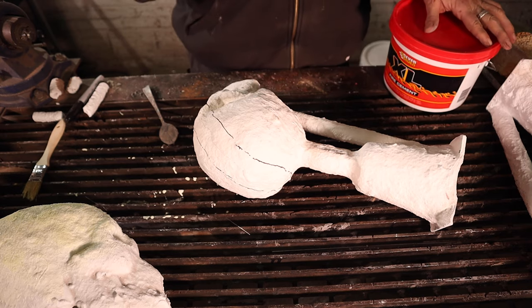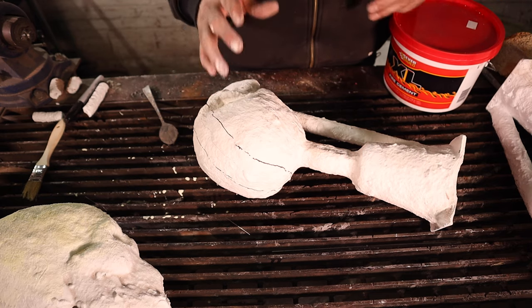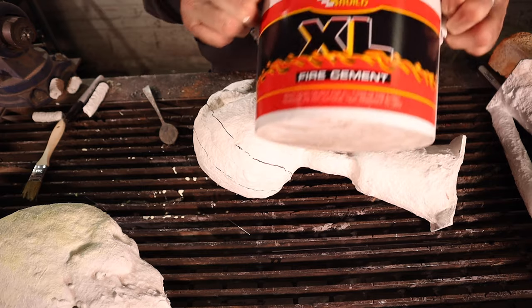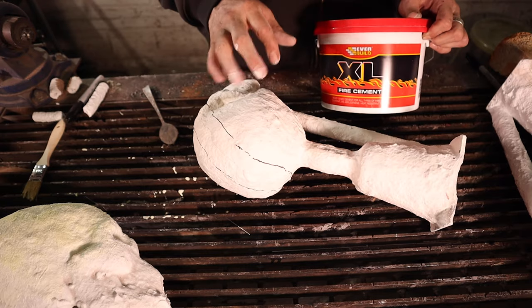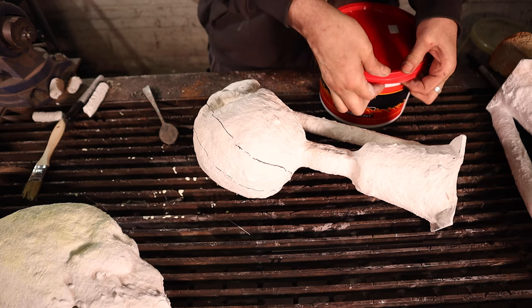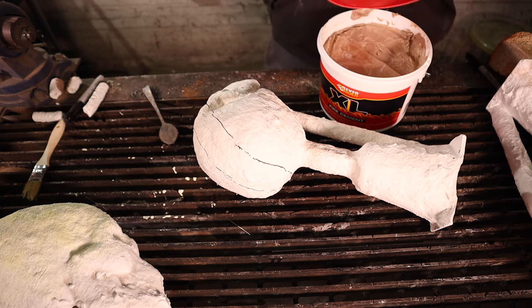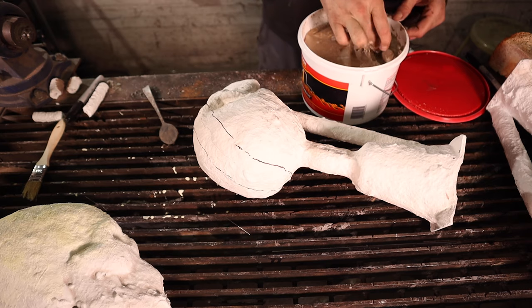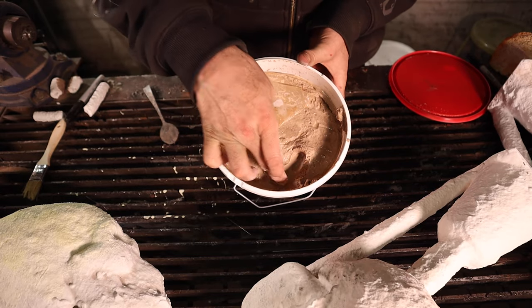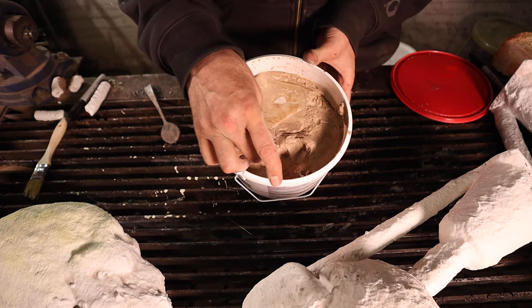So we've talked about our slurry and fiberglass fix and the Green Patch. The third technique I want to show you is using a refractory cement — in this case, the fire cement. It's referred to as a cement as opposed to the Green Patch being a mortar. Really where it comes down to is this is a meatier material. It has a lot more grog and sand, but it also has a tendency of holding onto its moisture a little bit more. As I'm moving it around in the bin, it's actually fairly plastic, almost with a very plastic nature to it.